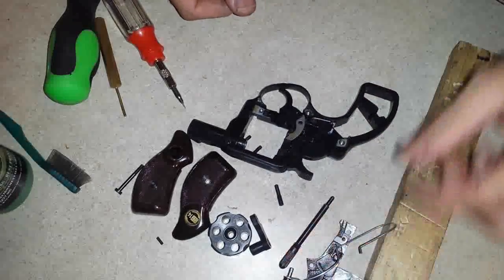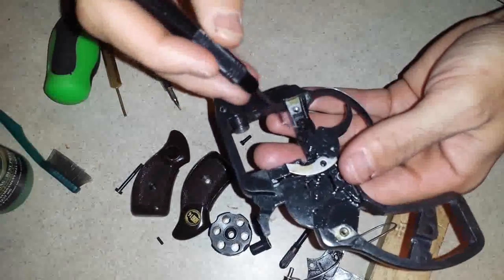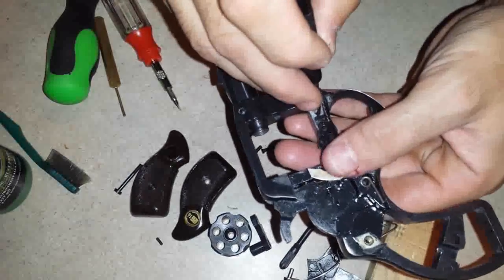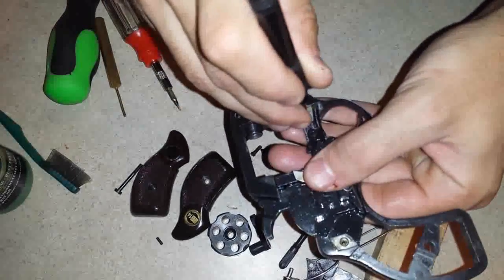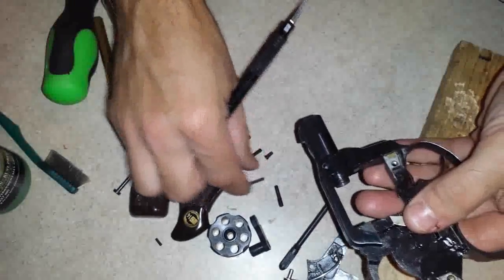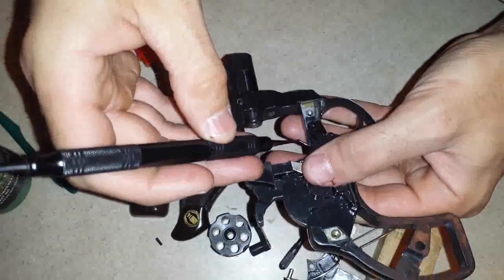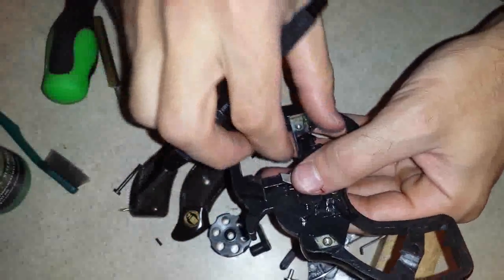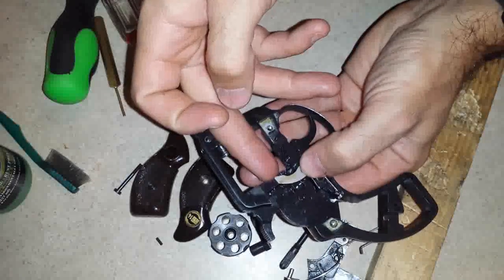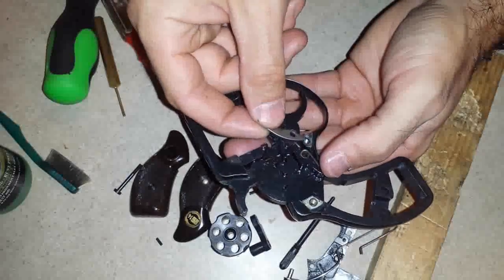You can remove your main spring. For the rest of this, I want to first remove this cylinder lock by releasing the tension from the spring. I'm going to hold the other parts with my thumb. That's your cylinder lock spring. The cylinder lock just kind of falls — I could actually dump this pistol to the side and it will fall right off. Grab that corner right here, lift up and down, and the hand comes right out.